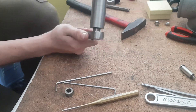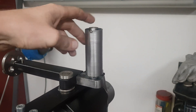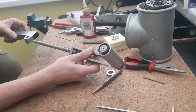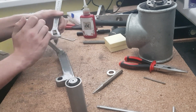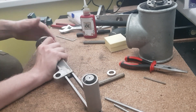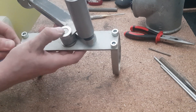The bearings are secured in place by this clamping ring. I realized that I was not able to tighten the grub screw on the clamping ring all the way, so I added a notch later. As the next step, the threaded rod and the moving part were added along with the hand wheel. To finish assembling, I put the mechanism onto the shaft and also secured it with a clamping ring.